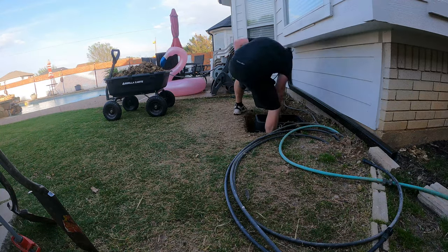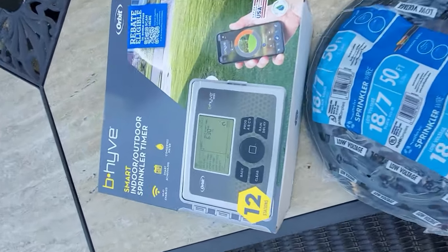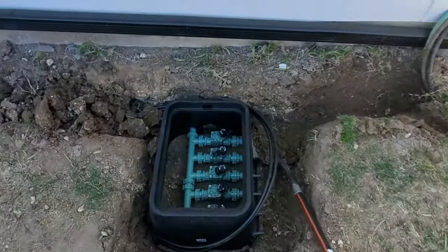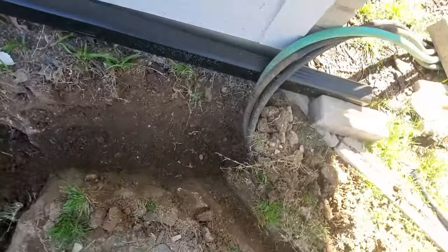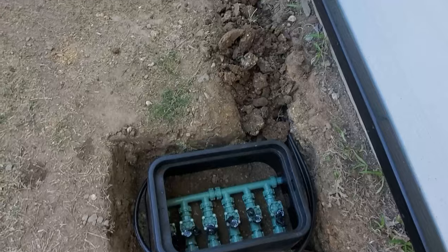I teased a while back that we were going to be doing some updates to the irrigation system. This is my DIY fix until I can tie into the main, which will probably be next year. I've done a lot of house repairs this year and I'd rather pay a professional to tie into the main. I went to a six-manifold Orbit system, tying into the poly that I already have run out and have been using off a manifold that ties into the actual sprinkler head itself.